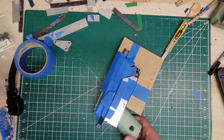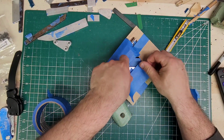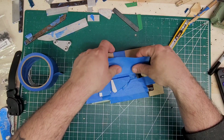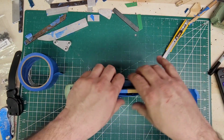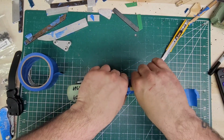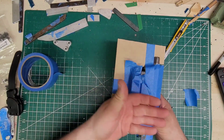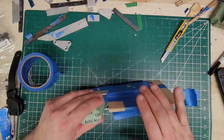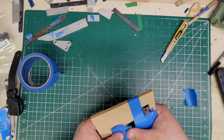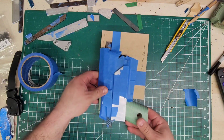All right, but seriously, take your widest piece of tape. Go from the grip to the end of the light. Stand it up, and then fold it over. Again, the reason why I do this is because if you don't, the Kydex will find a way to go underneath, and then you'll have to redo it again. And that's not fun, especially if you're doing a print and you only have one shot, and you mess that up.